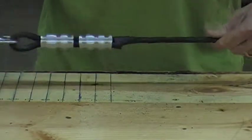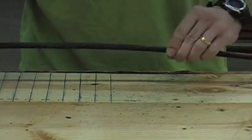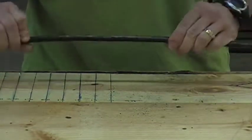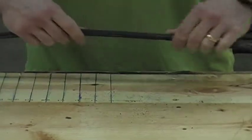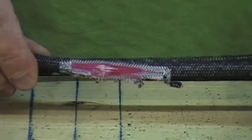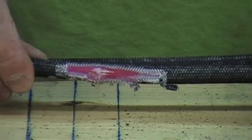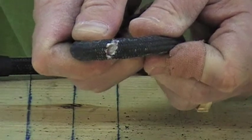After inspecting the snap hook and the compression fittings, carefully move down the pull rope. Look for cuts, burns, mechanical or chemical burns, or excessive wear as indicated by the exposed red core. Normal wear will be indicated by a grayish color to the rope. If you find any excessive wear or cuts, remove the complete unit from service.